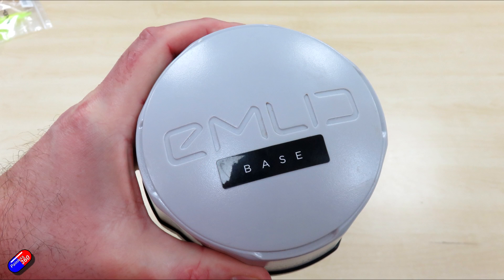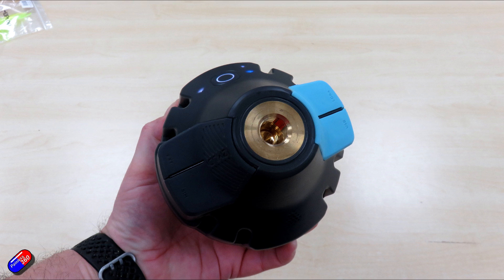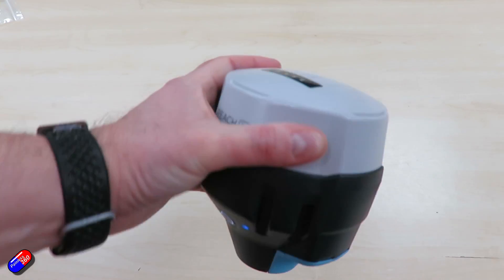So if you don't have your own base, or if you're a surveyor, you might pay for a subscription correction service such as Topnet or services from Leica, where you receive login credentials and can get corrections over the internet from a SIM card. People might also use bases with built-in radios. Emlid have produced a caster and there is a totally free version. There are some limits on the number of bases and simultaneous connections, but it meets most people's needs, with scalability available for nationwide coverage.